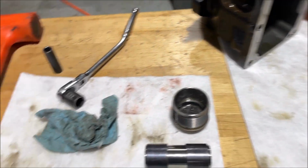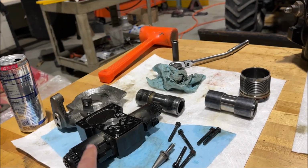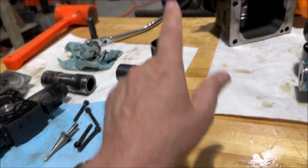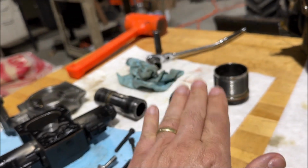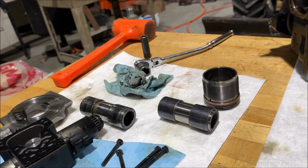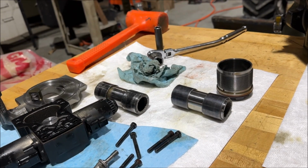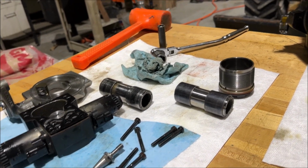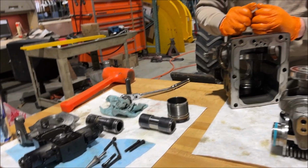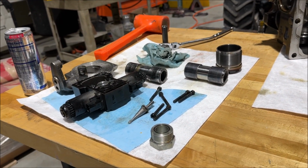But so you have a controller on the machine that's sending out the pulses to these solenoids. Does this have a foot pedal? Yes. So this and an RT80 both have a foot pedal. That foot pedal has an encoder, and it tells a computer its position. The computer then says, oh, he's pushed it down a little bit here. He wants to go forward, obviously. It sends out a signal over the data bus, the CAN bus, that's connecting everything together in these machines. And that bit of information goes to this motion control thing.